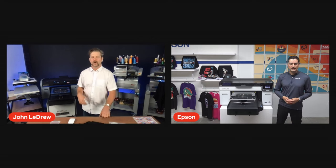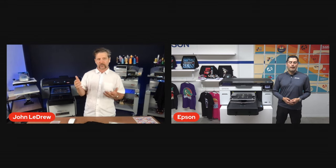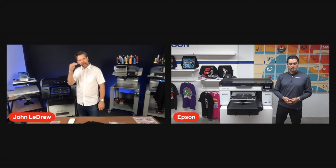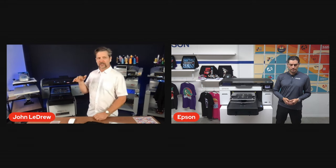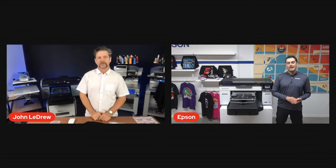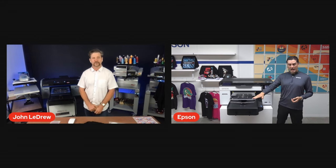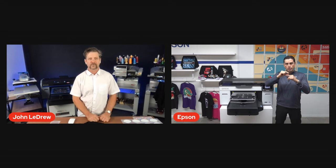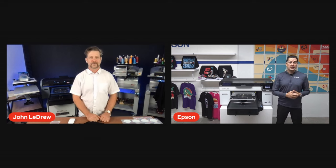You don't have to buy a whole new set of platens. When the printer makes that adjustment, you don't lose clarity or resolution. The printheads inside the carriage underneath the cover will actually adjust to the appropriate platen gap — so regardless of whether it's a shirt or a piece of digital transfer film, you're always going to get the highest resolution and detail. It's like having autofocus for your garments.